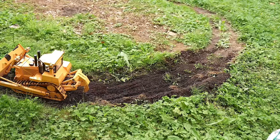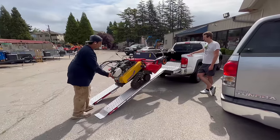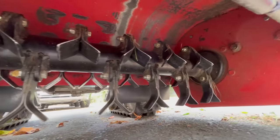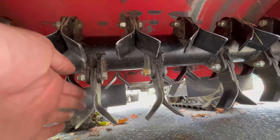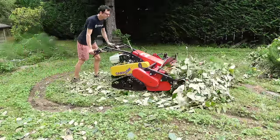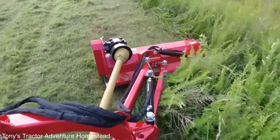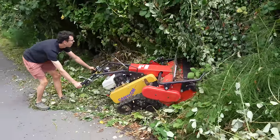If this thing doesn't live up to my desire for a zombie apocalypse worthy machine that will devour all types of vegetation, then what will? The closest thing I've found is a flail mower, so Colin and I rented one to play with — also because our neighbors complained about our yard getting out of hand. It's basically just a lawnmower designed for thick brush. Instead of a single spinning blade like a normal lawnmower, it has a spinning tube with a bunch of things called flails bolted on — basically just v-shaped knives. They can pivot so that when you hit something hard, they don't break, they just pivot back and the tube keeps spinning. This flail mower did a pretty good job at chewing through everything we threw at it, except for semi-rotten tree stumps. It did however do a good job at making it look like we at least sorta tried to clean up the yard. Bigger versions of these flail mowers are mounted on tractors and are used for clearing the sides of highways and big jobs like that. Maybe someday I'll build a mini flail mower for the bulldozer — need a metal shop first.